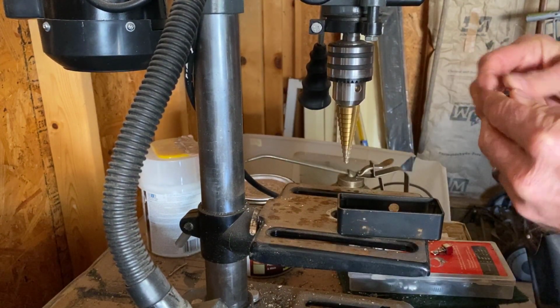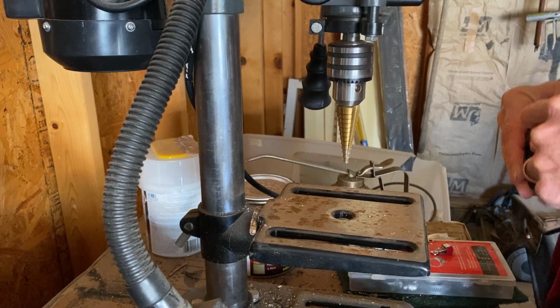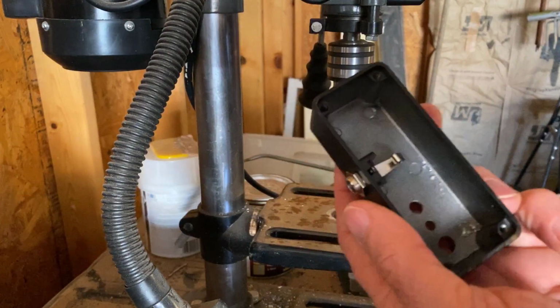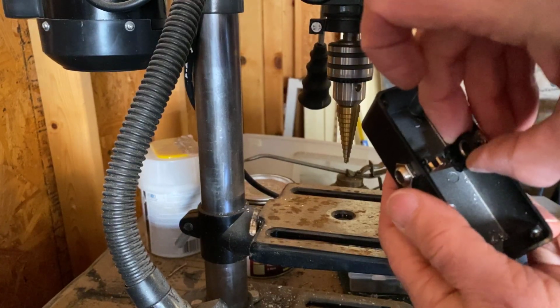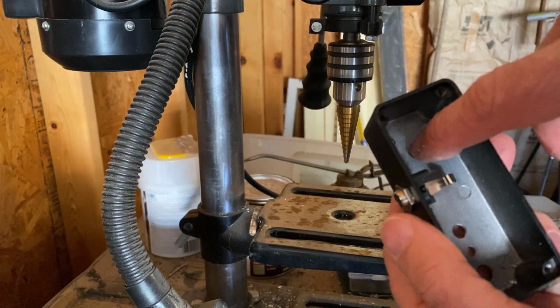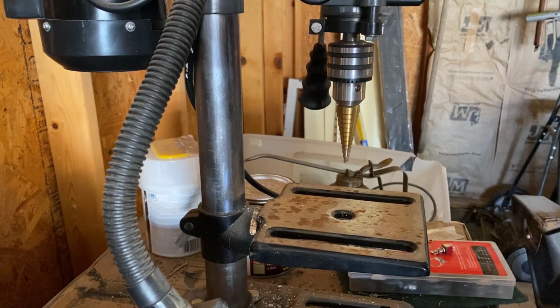All right, we're going to actually put this one inside, and here's the reason. Perfect. If you could see on here, there's really not enough room to go straight across from the input to the output jacks. This one's going to have to be offset to be down here. And remember, we still have to leave room for the foot switch. And I don't have one with me at the moment, so I'm going to make this as close as possible to where it needs to be, and I'll be right back.